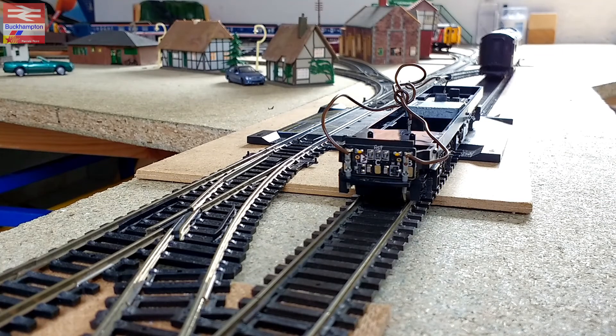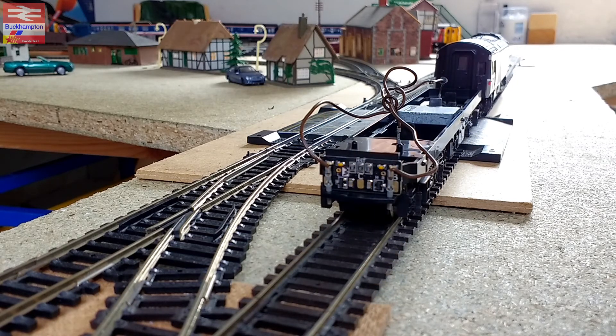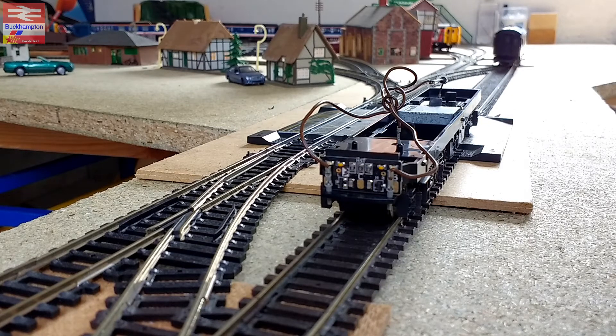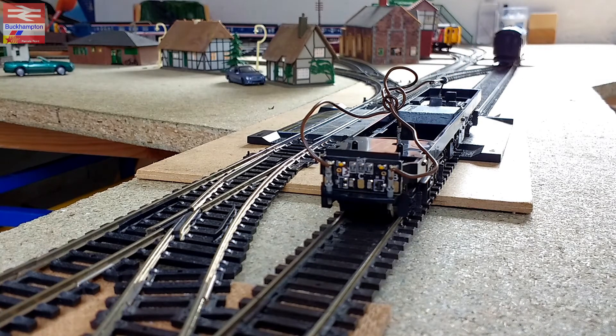What we've got to avoid is blocking those LEDs - the red ones are on the outside, and I've got the warm white, sort of yellowish version on these. I've had a play around and I think I've got things wedged in - no soldering yet required. I did find I had to swap over which wire was connected to which - it seemed to be around the wrong way. If I run the train, warm yellow lights as I run the loco away will now turn red... but it doesn't. That little black thing is called a diode - it stops electricity going one way through. We now need electricity to go both ways through to light up the red lights. That's my next job.